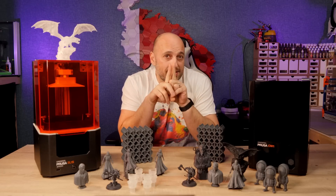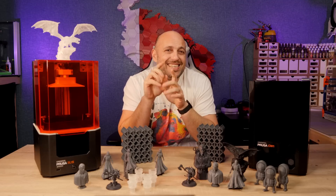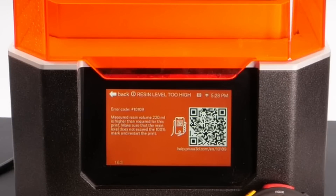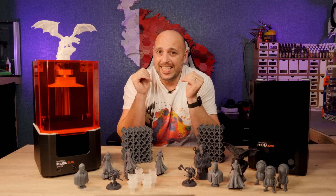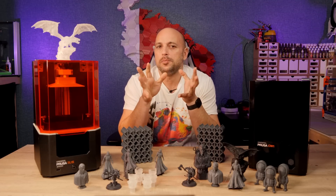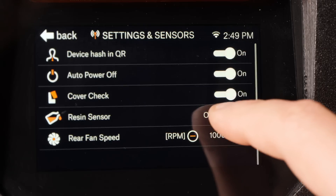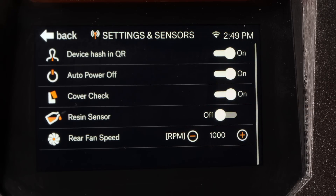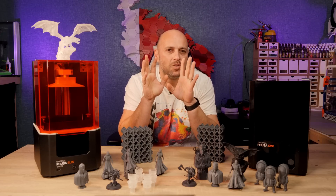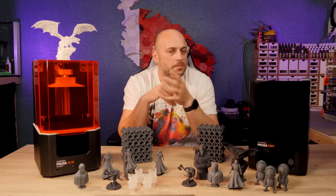The resin sensor on the SL1 and SL1S is also an awesome feature. However, while it works, it's not always perfectly accurate. Sometimes you fill the VAT up to 100% and it shows as overfilled and the SL1S will ask you to remove some resin from the VAT. This can be a pain sometimes and I truly believe it can be a quick firmware fix. So in the meantime I tend to switch my resin sensor off. Prusa Slicer gives you a pretty decent calculation of how much resin you will use, so I always keep that in mind when printing something that might need a refill mid-print.